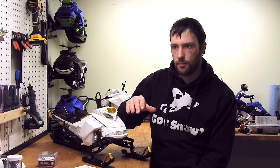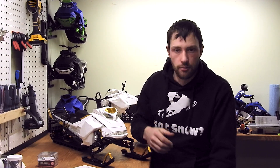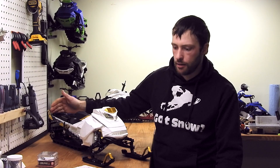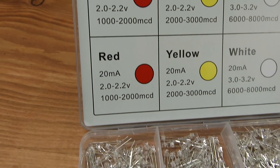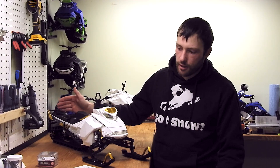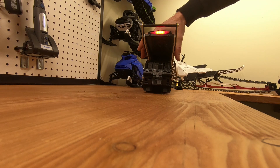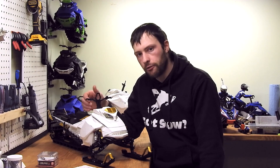I can flash the lights too. Having four lights connected all the time at either high or low power is one thing, but having two separate rows requires a specific wiring diagram to make it work. For the rear LEDs, they're standard 3mm clear bulbs — slightly brighter than colored bulbs. I have three of them, and when I give it gas and then slam on the brakes, the LED lights up brighter — just like a real machine. And if I back up, they brighten up as well.